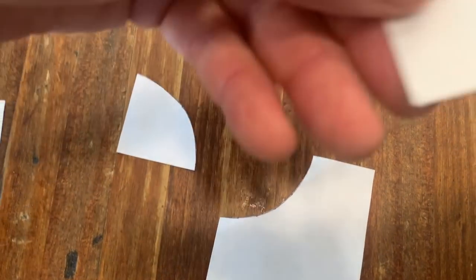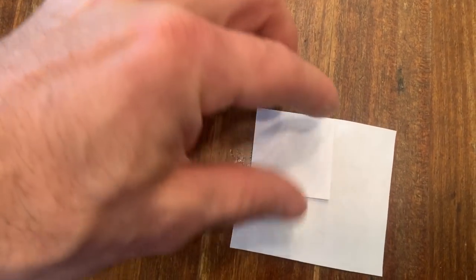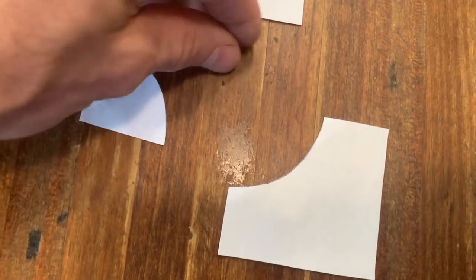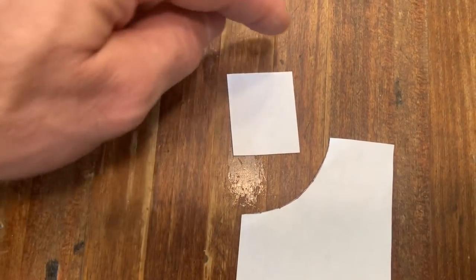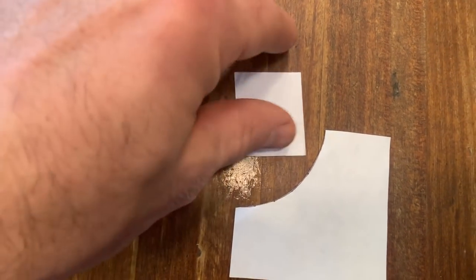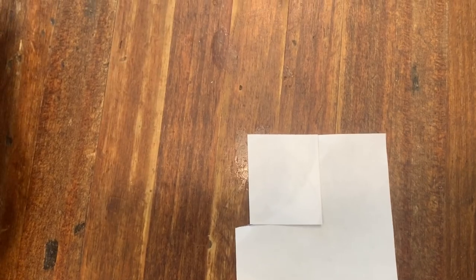So if you take 1 1/2 inches board and you run it past that, it is gonna take off all of that area sticking out beyond this blade. And you will end up with this. That part's pretty easy. So how do I make a smaller one? Well, if I just take a board rather than 1 1/2 inches square, I do a rectangle. This is 1 1/4 inches, 1 1/2 inches. And I run it, it will make that.